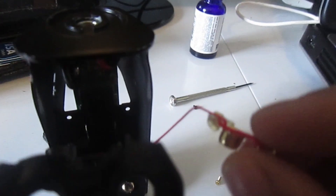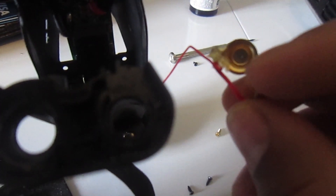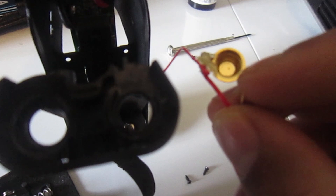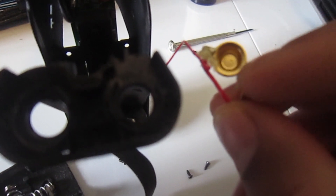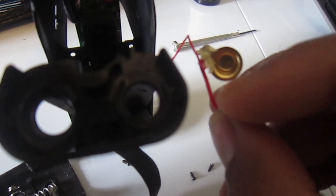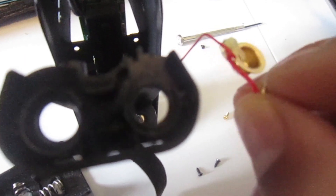This wire is very badly soldered from the factory — it was not soldered properly — and that's why it was giving battery check or imbalance battery errors.